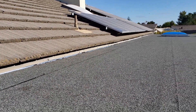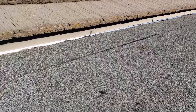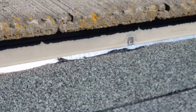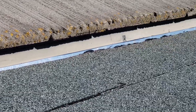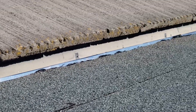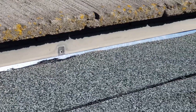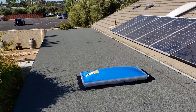We're back at the site of the new patio cover. The walking roof has been completed and you can see the detail we used to flash it. There used to be a rain gutter attached to the fascia board, but there was no way to put the new rafters on with the rain gutter in the way — the old ones were only two by fours. We had existing edge metal and were able to get our flashing up underneath the edge metal, so now we have proper flash counter-flash all the way along the roof. The new gutter will go on the back side of the fascia board.